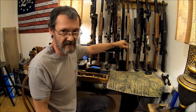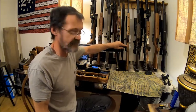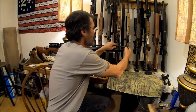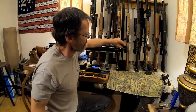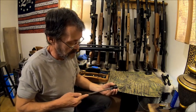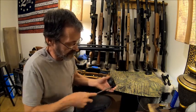Now we're going to individually do this one. I always leave the thread protector cap on it because if it'll fit over that, we know it'll fit over the barrel — the cap is just a hair bigger, not even a hair, it's half a hair. See, I can go on but it stops right about three quarters of the way, which means that high side is there because of the 3D printer. So we're going to do the same thing to that — the same exact thing we did to the tank hole, we're going to do to the barrel hole.